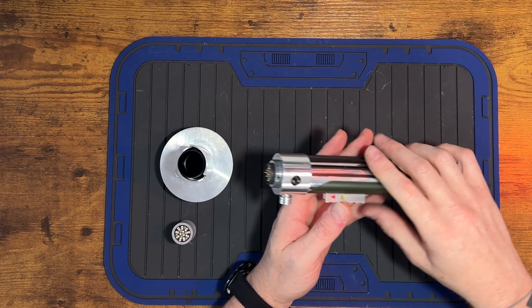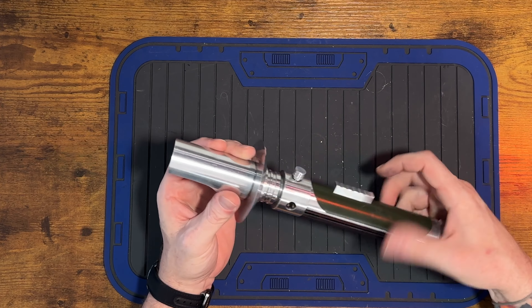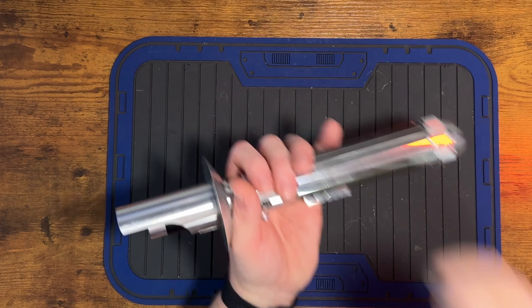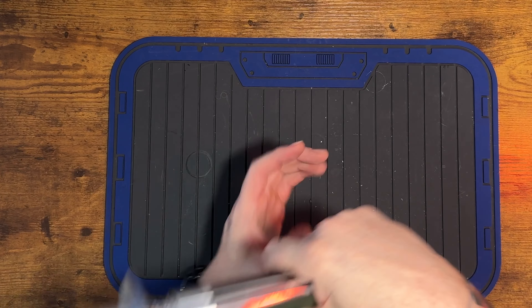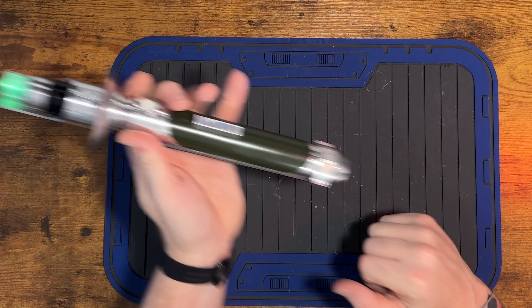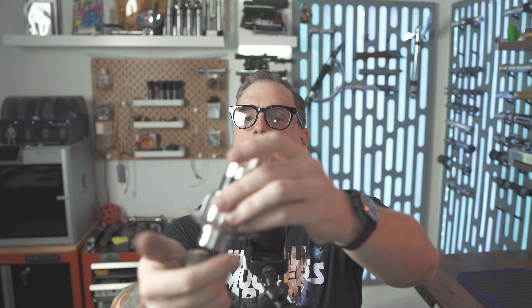There are those lit arrows. That is why I did the emitter the way I did — it's removable. You can just thread your emitter in place and you're ready to go. Just note that little PCB holder that lives in the emitter — there's no set screw holding it in place. It just press fits in there when you thread it in place. It just lives in the emitter and can be removed.